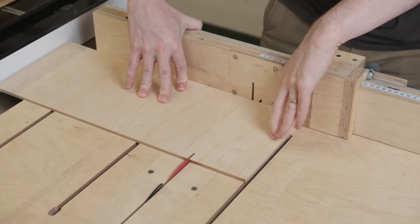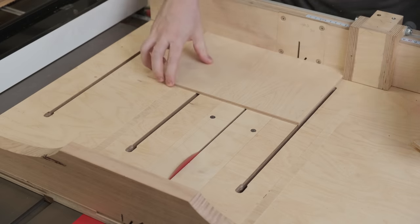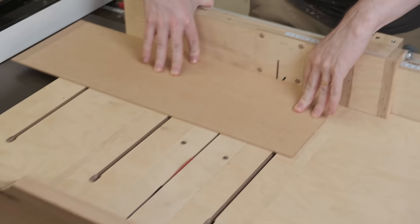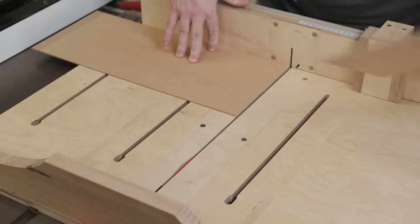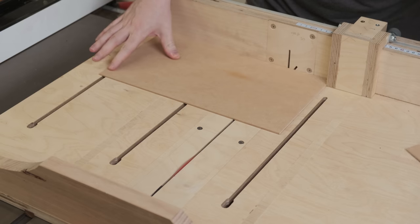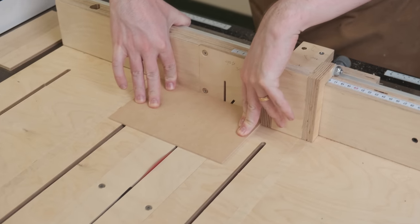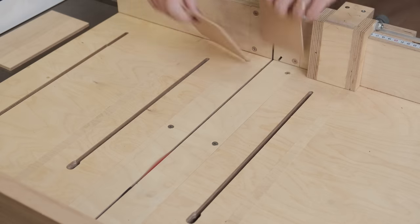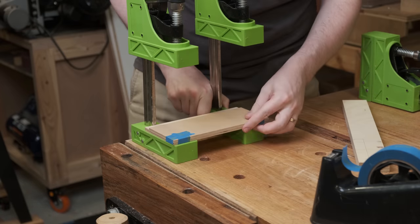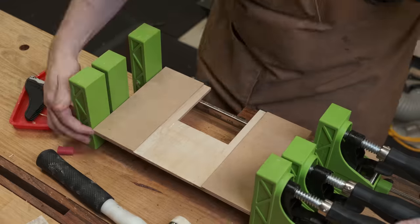The top carriage is made up of 6 pieces: 3 of 6mm plywood and 3 of 3mm MDF. These pieces will overlap on glue-up — refer to the plans for the exact dimensions. The general idea behind Nopono version 2 is to make it easier to build. If you have access to a laser or CNC, you could make this out of a single piece. The two outer pieces create a rabbet when the MDF is glued to the plywood. The inner piece has a smaller plywood piece with the MDF overlapping the two outside pieces.